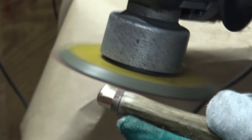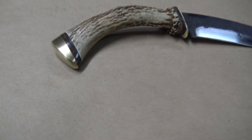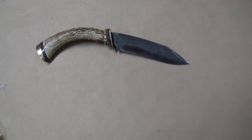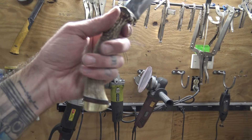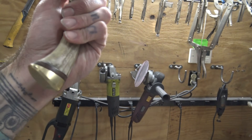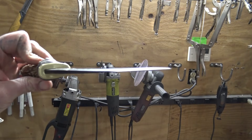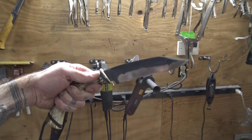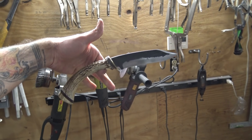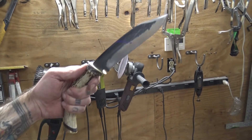After sanding with a file we're going to take the DA — dual action sander — starting with 320 grit and stepping through a few grits to get this sanded down, then we're going to polish it up. And there's your finished knife. We did a wet polish with some water and a piece of wood on that leather, and then went through and polished the whole thing up — I think it turned out pretty nice. Hopefully we gave you guys enough information so you can go through and do this without making it too overwhelming. You can get into the science of hardening a piece of steel and there's really a lot to it, but I tried to keep it simple. You can see it's got a good feel to it, good grip, and it's got a good balance to it too. All in all I think we got a pretty good backwoods looking knife here. Thank you for watching.